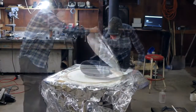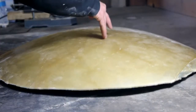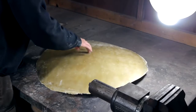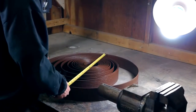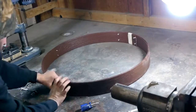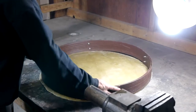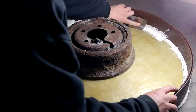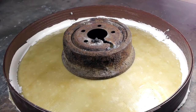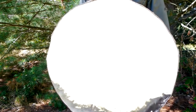Finally, I get to see the result. Once cleaned up, the reflectiveness is actually very good. The fiberglass is just a little too flexible and wants to curl up like a taco shell. If it's pressed against a flat surface it still holds the parabolic shape, I just need something to keep it there. I found this plastic landscaping trim that seemed like it would work well for this purpose. I quickly shaped it into a ring and held it together with nuts and bolts. The ring was placed on top of my mirror with a weight holding it firmly against my workbench. Some caulk secures the ring in place, and here is the final result - not too bad for being made from a $1 space blanket.